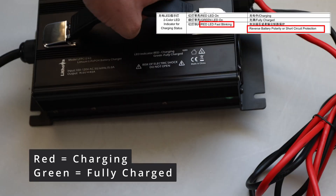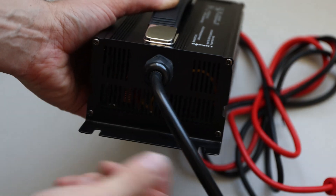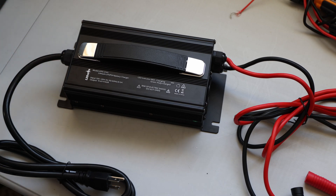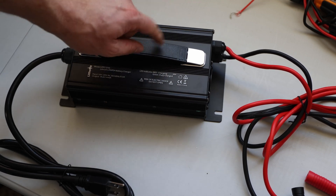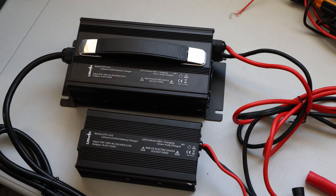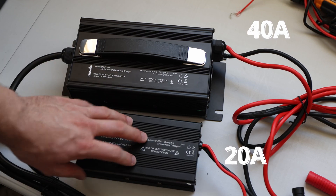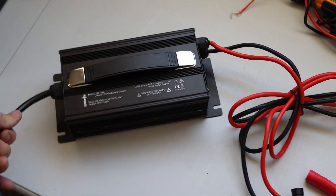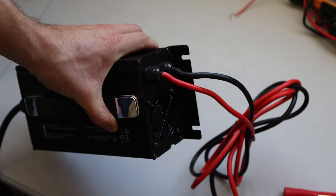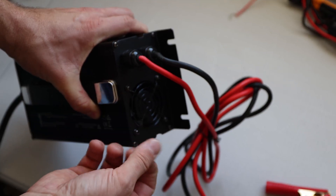It's quite small — there's not a lot more, there's no display. When you look at the side, it's just aluminum housing for cooling. Then we have this side with a good solid power cord connection. We have the opportunity to mount it with some bolts, and we do have a little handle to carry it, which is really nice because it is bigger. It is bigger than the smaller version. The 20 amp and the 40 amp both have a nice aluminum case. They made a great job with the power cord connector and the 8 gauge wire going in — negative and positive separately — with a nice crimp so you cannot touch it or hurt yourself.